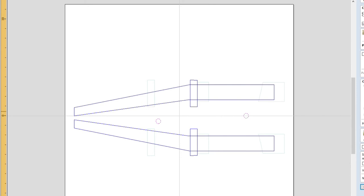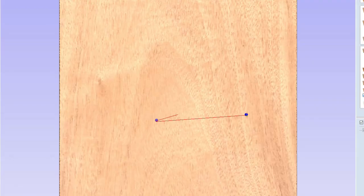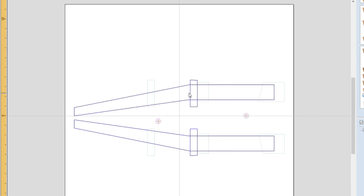Okay, we're on the back side. We'll dado out for the seat and set that for 2/10. You will be fine. Then the outline of the profile, I cut that at 8/10, and it did a fine job. It's right on the money.